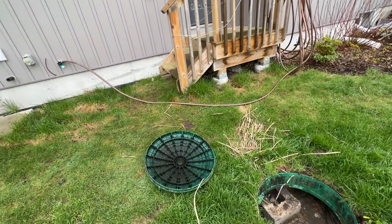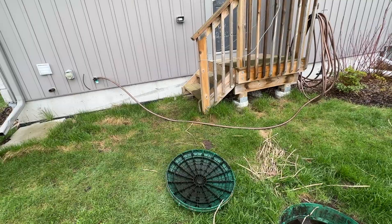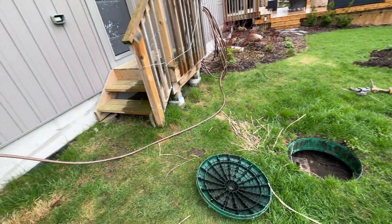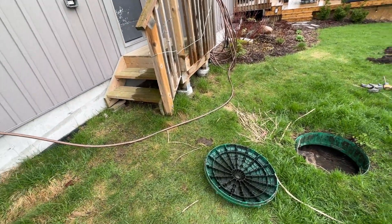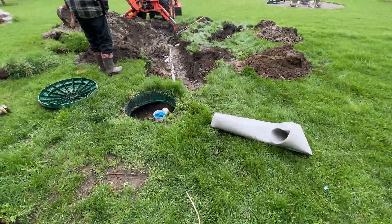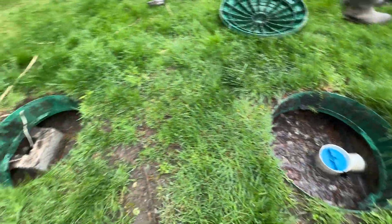Now in the house, you can usually find the direction of the septic tank. There's a big black ABS pipe that'll be leaving the house out of your basement. Your tank should be at least 1.5 meters, about five feet from the house minimum. Then once you go out, you have your bed. If you have any questions, just comment down below.